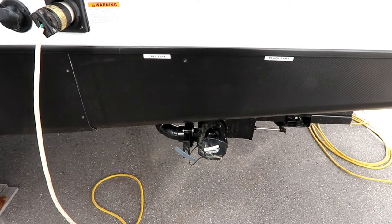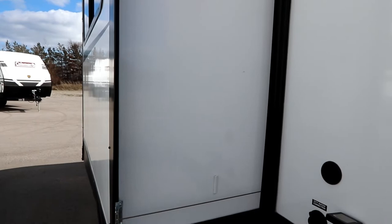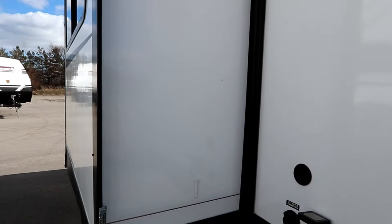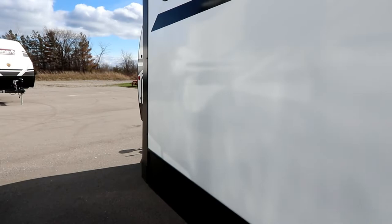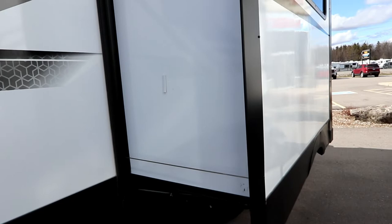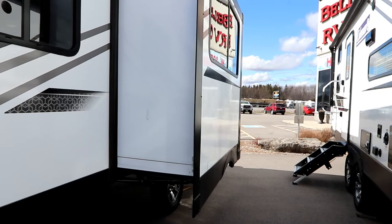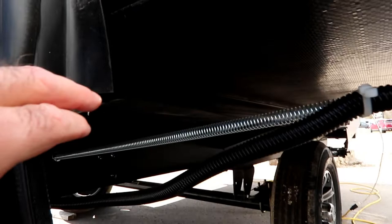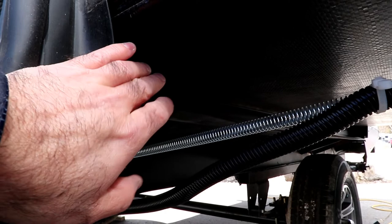Something to note: Coleman is using a cable system for their slides. For those who may not be familiar, cable systems actually give you the most even pull in and out when the slides are being moved, and give you positive pressure at all four corners — giving you the best seal available. Cable systems have to be weighted properly for their use and the size of the slide. When you have a small slide like this, they're a great option. Underneath, I always like to look for splash guards underneath the slides that direct water away from slide components and seals, giving you that extra level of protection.